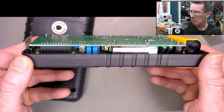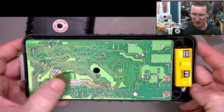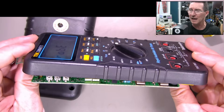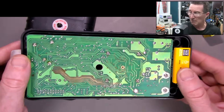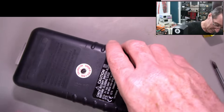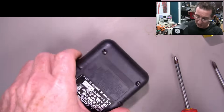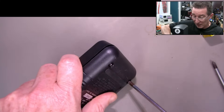The 870 model looks identical - layout, PCB. It's got the solder mask removed, exactly like the 916. The 870 is the top of the range of the 800 series, like the 916 is the top of the range of the 900 series. Seems to be an identical meter. Maybe they sold them in different markets, or maybe there's some little feature difference. But they're all true RMS.